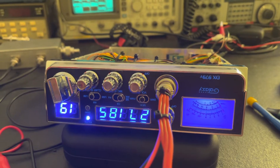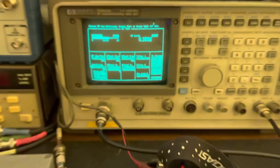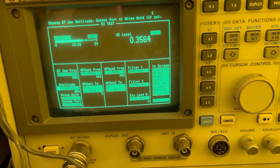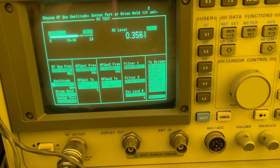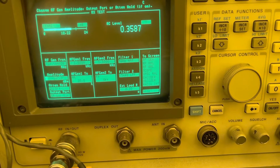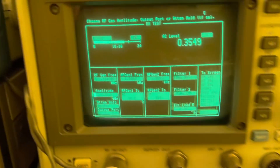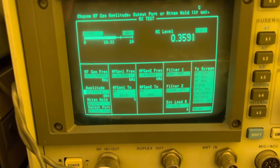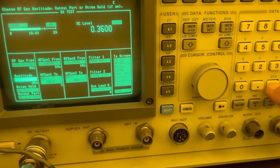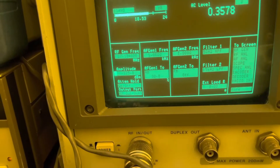I'll let you hear what she sounds like on transmit later. I moved on to the receive and she's doing really well. Right now we're at one microvolt, minus 107 dB, and she's showing 18 dB of SINAD. I kept pushing her down — let's go to minus 120. So now we're at minus 120 dB and she's still showing 18, and I wasn't sure if I believed that. Minus 125, still showing 18.